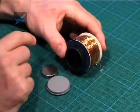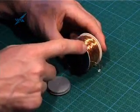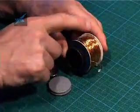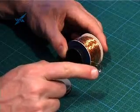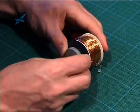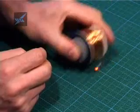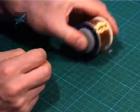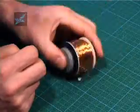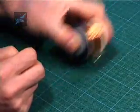So the Shaker Gen is a very simple device. We've got a film can here. We've put some cardboard circles onto it, and that allows us to wind the turns of wire onto it. We've got between 500 and 1,000 turns of wire, and then connected it up to the little LED bulb. Simply, we've put the magnet into the can, put the lid back on, and if we shake it, we can see that as the magnet goes through the turns of wire, it's inducing electricity into the wire, and it's enough to power the little light. And we've got the Shaker Gen.